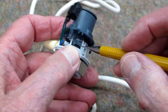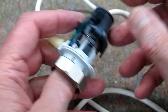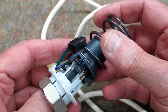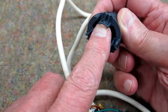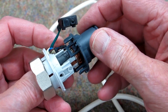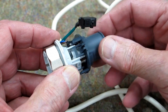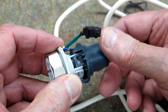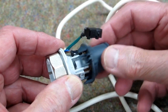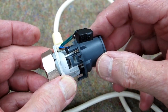We'll take this apart a little bit further and look at this wax pot mechanism. Like a lot of this stuff, it's not really meant to come apart. I just took a screwdriver and released these three catches. The wax motor lifts this and the spring returns it. The top part here is pushing against the top of that finger, and the spring pressure pushes down on it. This is a symmetric piece, so there's really no way to assemble this incorrectly.